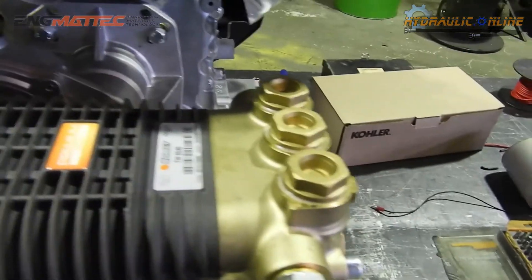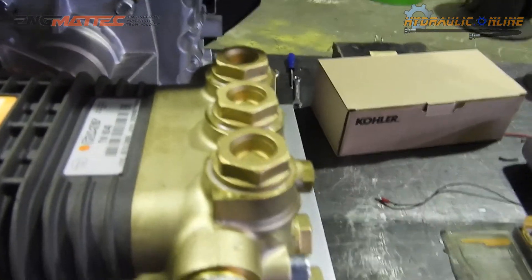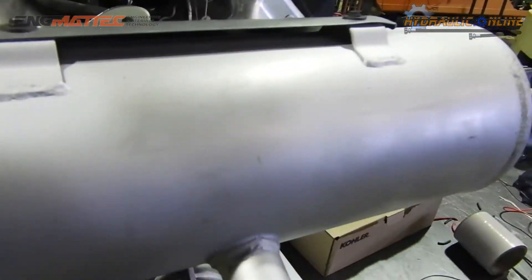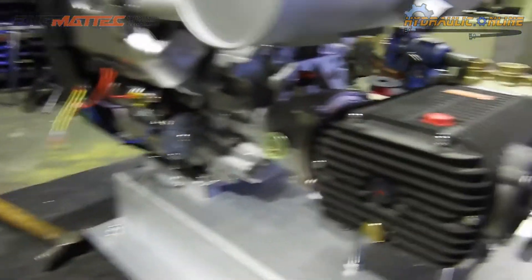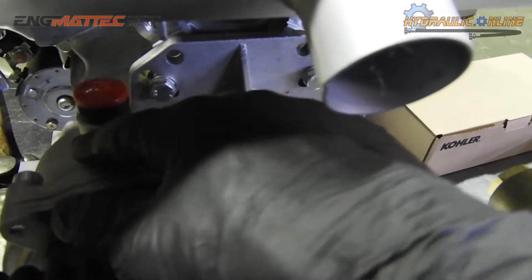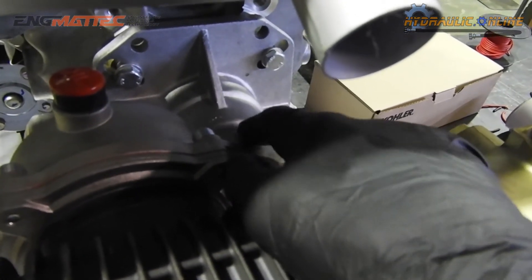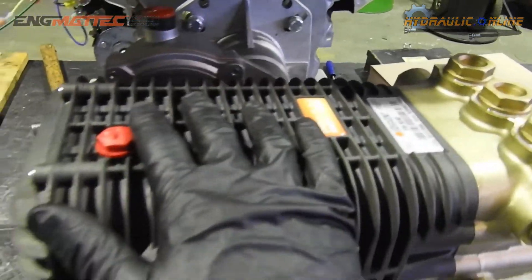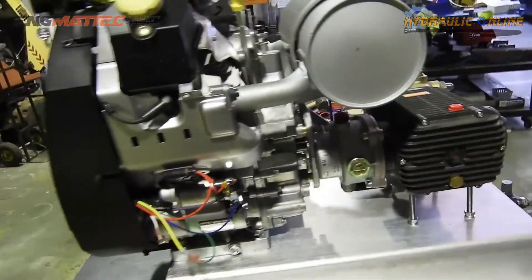It's a three-piston unit — three horizontal reciprocating pistons made from a ceramic material. It's probably designed to run between 1,000 and 1,400 RPM. But if you've got an engine designed to produce its power at 3,000 RPM, you're going to need a gearbox of some sort — so here's the reduction gearbox. Small gear in here, large gear in here, and the reduction ratio is about 2.1 to 1, taking 3,000 RPM down to around 1,400 RPM that this pump is designed to run on. These pumps are obviously designed to be run by electric motors, but if you don't have electric motors on site, this is what you've got to do.